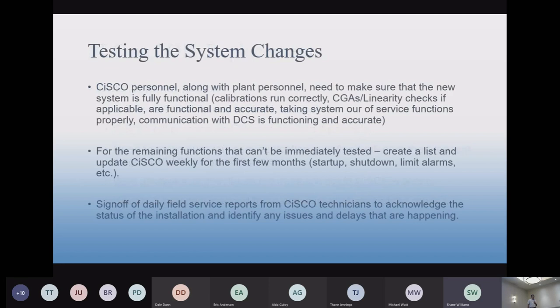Sometimes there are also communications issues between the existing PLC and our equipment. We may have to have them lay fiber or something of that sort, because the plant network is not up to date. We have the older modules, we step cards, but that's easy to change over. But they don't have the infrastructure already in place. Good point. I suppose you could put in a protocol converter to work too.